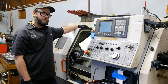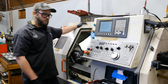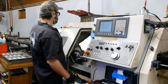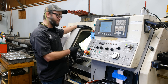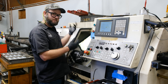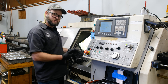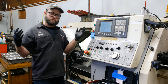This has made a ton of stuff over the years. We've put a lot of money into it the last couple of years just to keep it going. It's uniquely sized — it's actually the only machine that fits here, as far as I can tell. At this point we're going to keep it going. We put a whole new turret assembly on this machine last year, just took the turret off the carriage and dropped in a brand new one — had the place send us a new one, put it in, and it's working great. The spindle probably needs to be done, but it still has the original spindle from 2008. Tailstock's fine, everything's super square — super great.